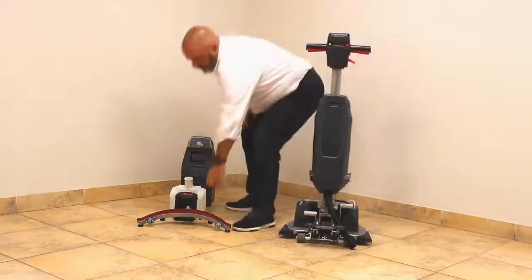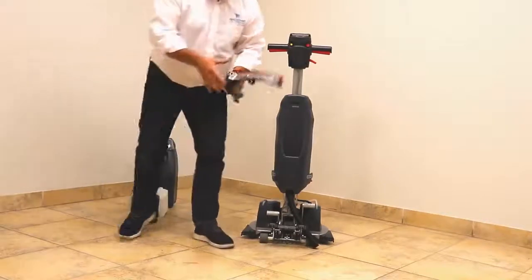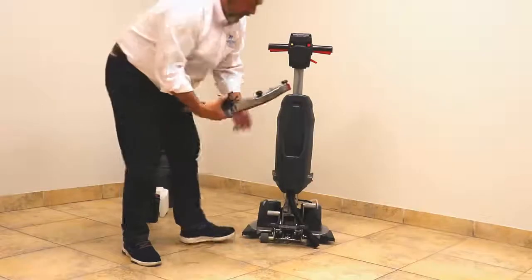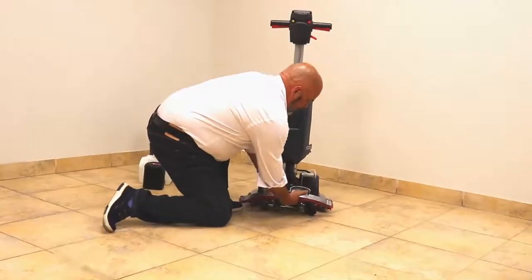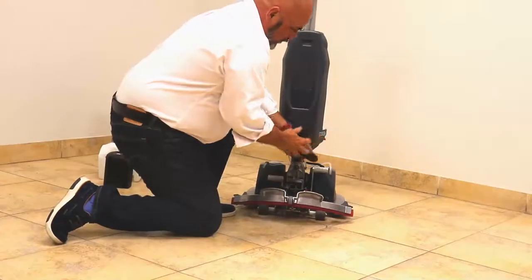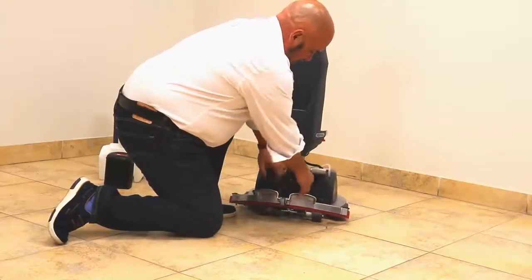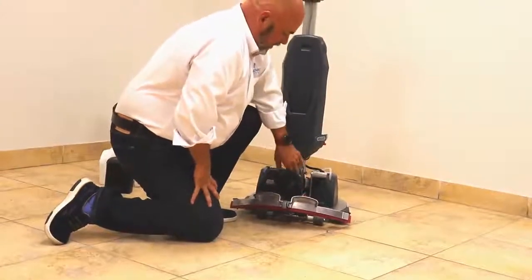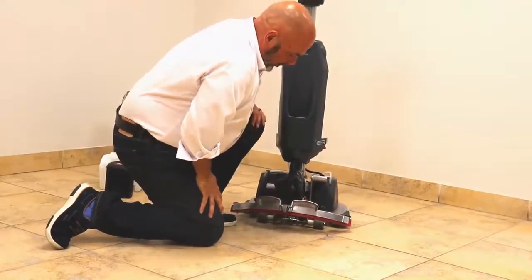and the squeegee itself, you can see it's got the toe pegs here, so you can raise and lower it on the machine. It's got 2 little silver mounts here where the little silver bolts are, and it just clips into its own little area here. Easily clips in. You're then going to attach your vacuum hose. It comes equipped with a P-trap. I just take it and clip it in its 2 clips at the back of the squeegee. Easy. You can see it's got the rollers on the back, so it rolls along the floor.